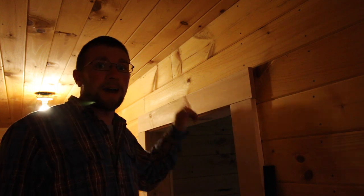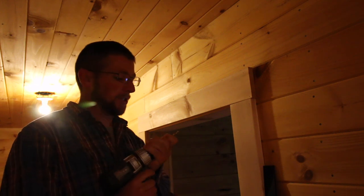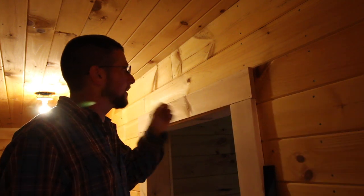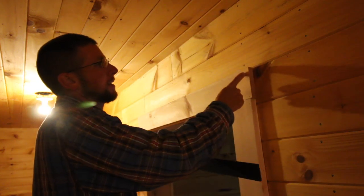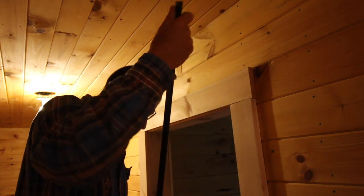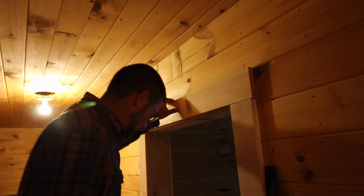The slide rail is really nice, but the directions are terrible. Luckily I have one already up and I kind of remember — we did that last year when we bought two kits at the same time. When you order your slide rail kit, you want to make sure you order them for your door width. One thing I messed up on: the placement of my rail on the other door. This rail is 72 inches long and our door is 36 inches. You need to run your rail to the same position where your door's going to be when it's closed, and that'll give you the same length left over on each side. If you want to see the little beast that was sticking its paws out from under the door, I'll have to wait until the end of the video when Gina and Olivia get home and they can show you Figaro.